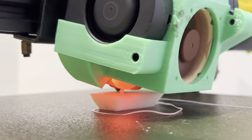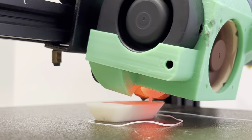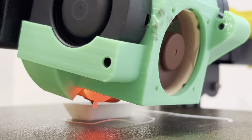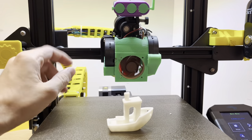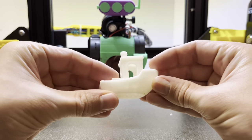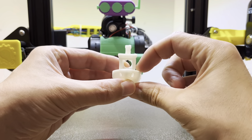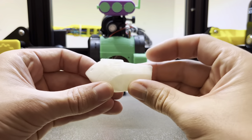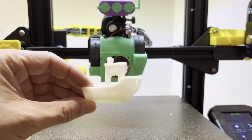This is painful to watch — just look at the BL Touch crashing into the print, not to mention the printing head just bouncing around as it runs over the part. I cannot believe we just printed this benchy with this printing head — this thing is just holding on by a thread. And actually this benchy looks pretty decent. From the front, we can see this cabin is skewed a little bit, and on the back side there is some ugliness. But for what we're working with, I'm surprised it looks so good — this thing was printing at a 20-degree angle.